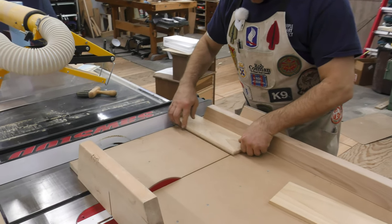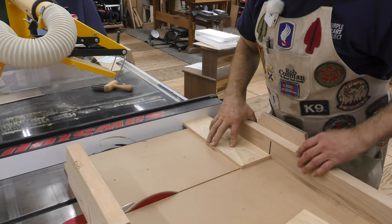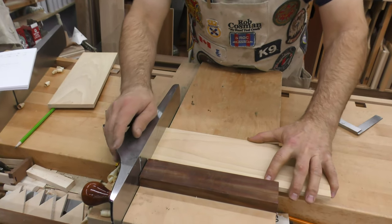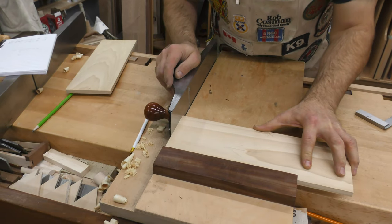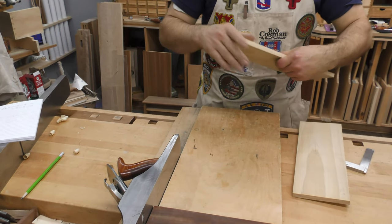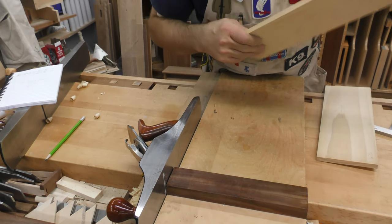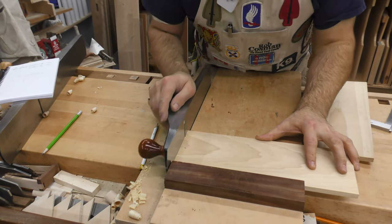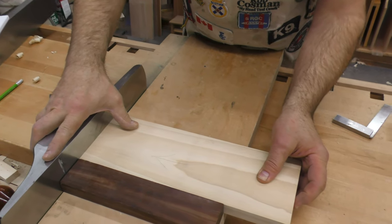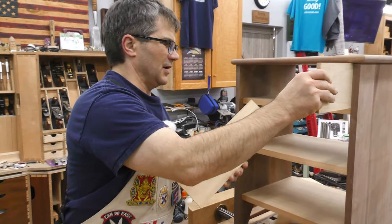Reference edge. I've got the inside surface up so I can get a cleaner cut — remember the outside is going to be planed away. This is the back — cut a little chamfer. One, two, three. Set that on there and they're nice and flush. So there are our two sides, done as far as we need to take them right now.